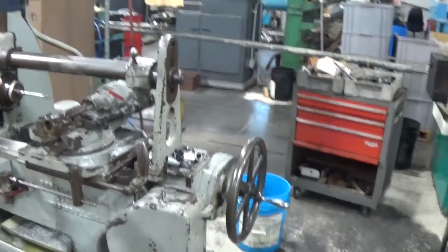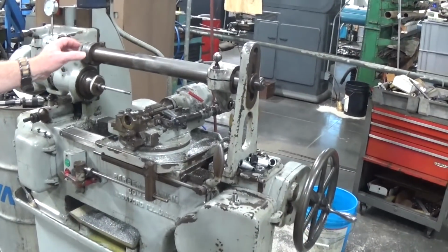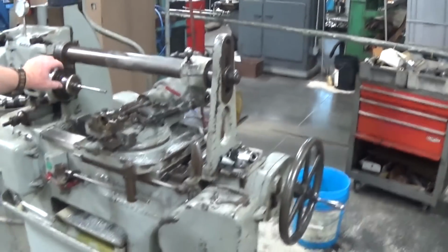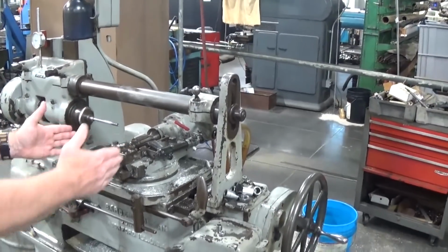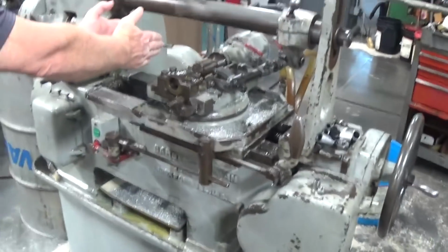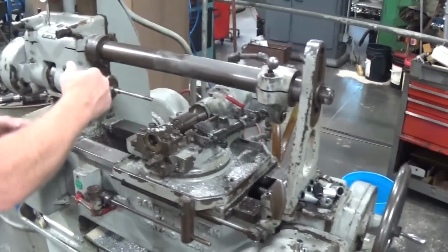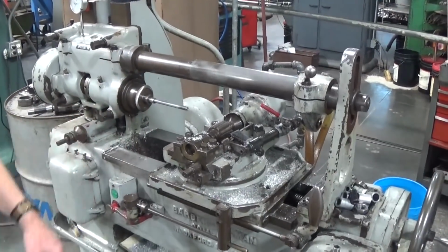Typically for our thread cutter, which has 15 different gears, you'll mount a number of rings on here, and it does the same thing, but you can see the travel is much greater. We'll have a dozen parts here, and it moves forward this way, and then these rotate this way until all the gears are cut.